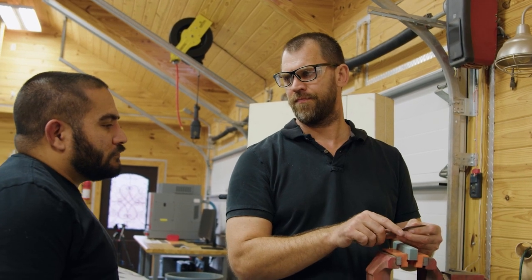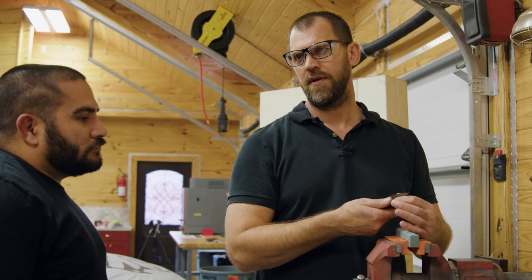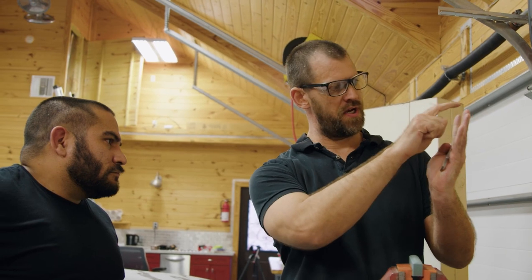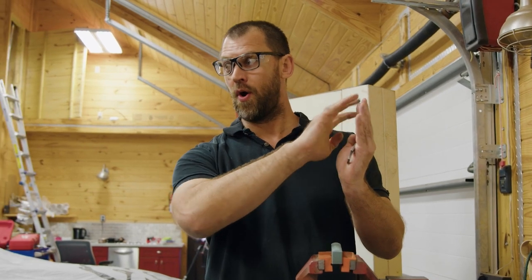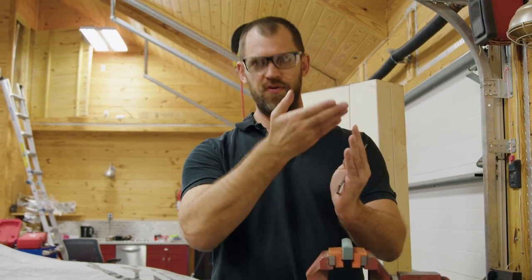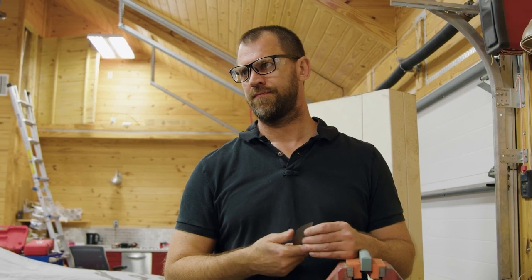Doing an aggressive grit on one side and almost a polish on the other creates a terrifying edge. We did those originally on the dewclaws and they were frightening. It's like a microscopic serration — you've got teeth on teeth. I've got my 220-grit teeth which are jagged, then I polish the back so on top of each tooth I have a polished edge. It grips and cuts, grips and cuts. We were cutting eighth-inch leather like it was paper — shredding right through.